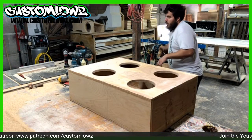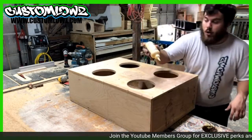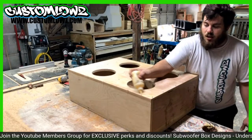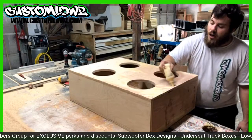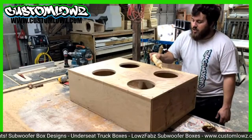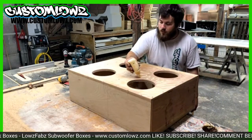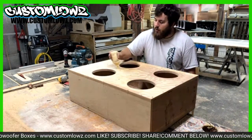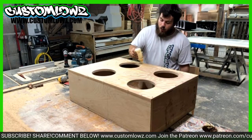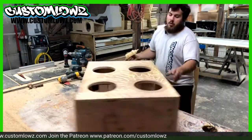In a pinch, depending on what I need, I will go with Diablo or Freud from Home Depot. You can get those bits at Home Depot almost any time. I do like their bits quite a bit. They last a long time. I use their 3/4-inch roundover, and that thing lasted me a long time. The only reason it really went out is because I tend to router through nails so much, not that I actually like to, especially with that big of a bit. When you're nailing your pieces together and then taking off a roundover that large, you will cut through some nails for sure. So those are good brands.